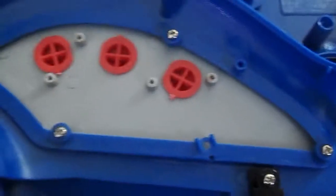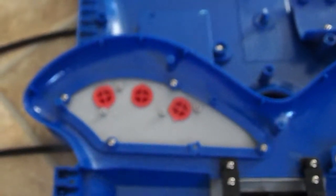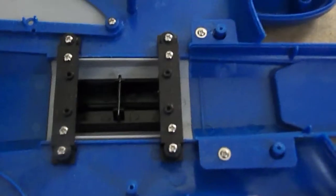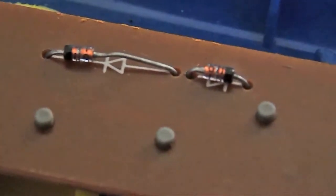Notice that in this guitar, there are no ICs or microcontrollers on the PCB boards. All the buttons come on their own plastic panel, so they can be separated from the rest of the body. That makes these systems easy to reuse and remount elsewhere. But there are a bunch of diodes scattered around the boards — they allow eight buttons to use only four wires to send signals. It's ingenious, really, and very old school.